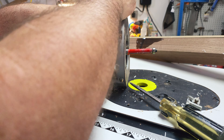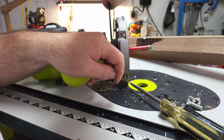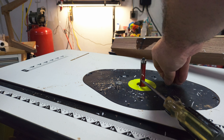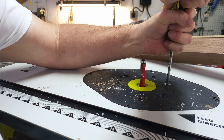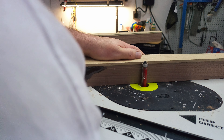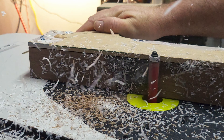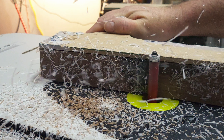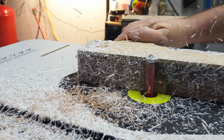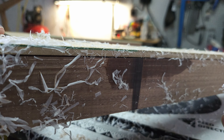The sketchy thing about this is I'm pulling the bit out of its jacket so to speak, so it has the risk of flying out. I did actually have that happen with this router one time — I was routing and it just started coming out. That's kind of scary — it's hard to duck from a router bit. So just be careful. This is a huge bit, extends quite a bit. There we go — okay, now we got it. Now we're cooking with gas. It's like a snow globe — look at that, it is kind of cool in a way. I could see why epoxy is trending right now — it's pretty fun to work with. There we go, it's looking good. Look at that divot — the monstrosity — and look at it just clinging to me.